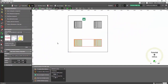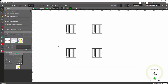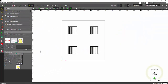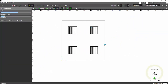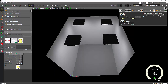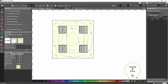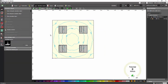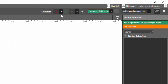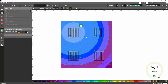I selected the photometric file that has an emergency version. But in reality, the usual fitting — if it's not emergency — is 3,200 lumen. If I run a calculation, the three normal luminaires will give around 3,000 lumen, and this one will be 300 lumen only. Let's see how it looks in false color. Right now I can see these are all still normal. If I go to the emergency version and select the light scene, then run a calculation again for this emergency light scene — yes, you can see now that this is the emergency version.